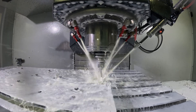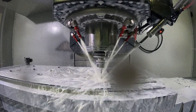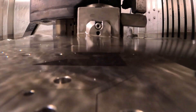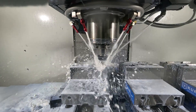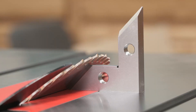First, three-eighths inch thick stainless steel sheets are fed into one of our CNC machines for drilling the holes, then right into the wire EDM machine where the shapes are cut underwater by a thin electrically charged wire that erodes away the metal for extreme accuracy. Back to the CNC to bevel the edges, leaving a thin, almost sharp line of the EDM cut surface as your perfect reference.